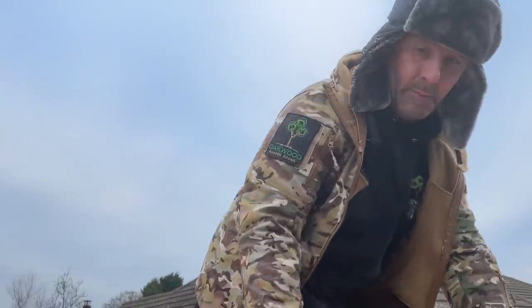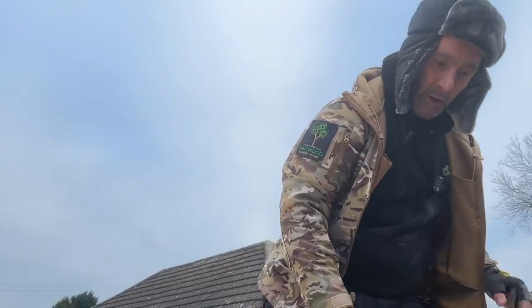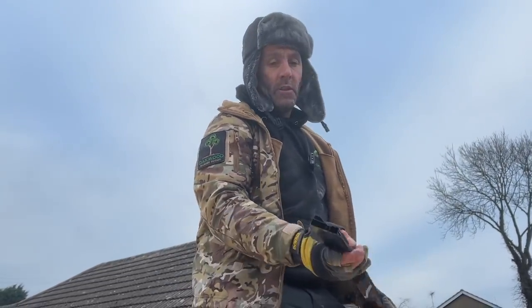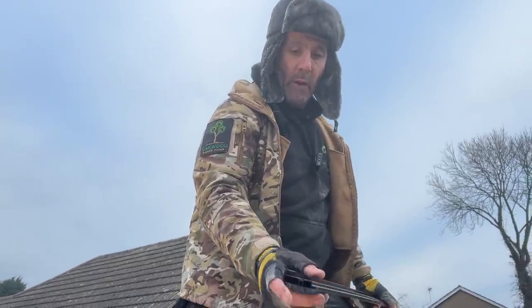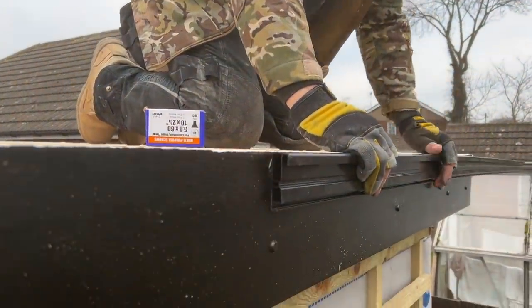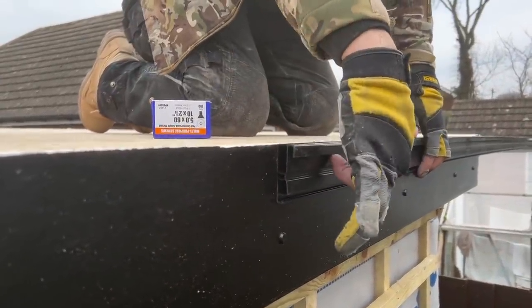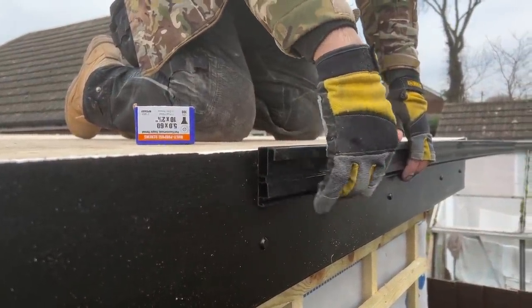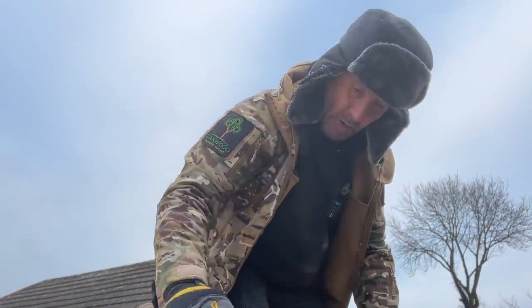It's probably as wise to do this now if you're going to do it on your own — it's a two-part gutter trim. There are two sorts available. This, in my opinion, is the best gutter trim for the rubber roof. That's the first part — it screws on there like that. Then the rubber goes over the top and it tucks up through that gap, and it's then fixed by a second piece of the two-part gutter trim closing it.